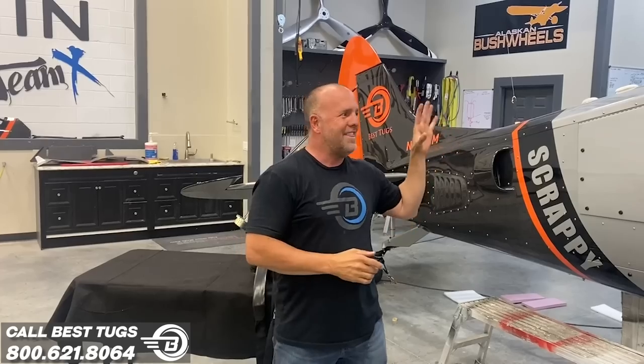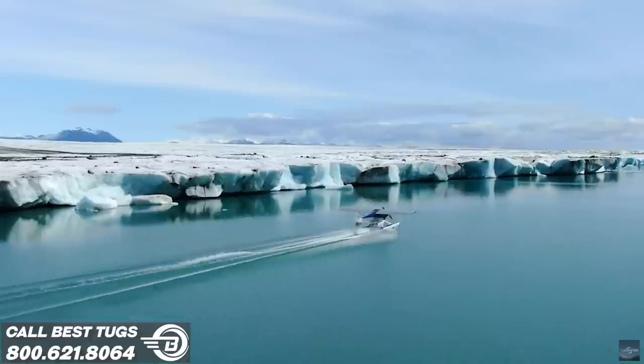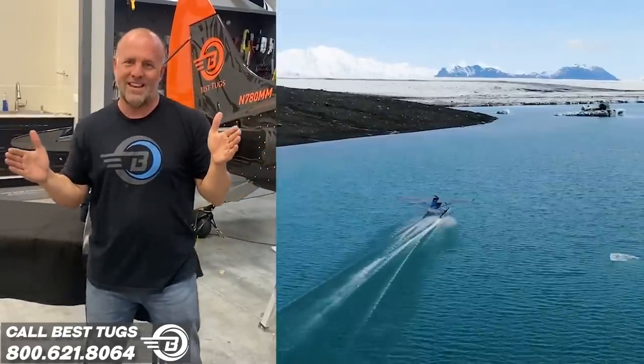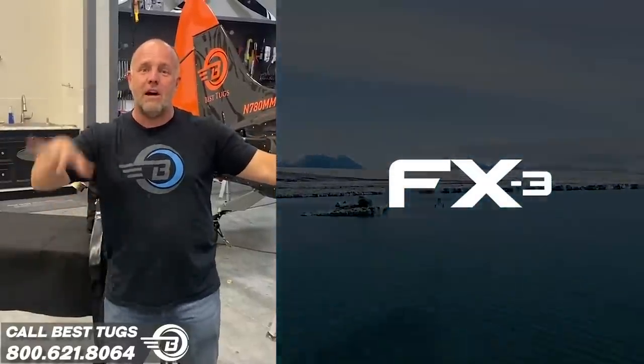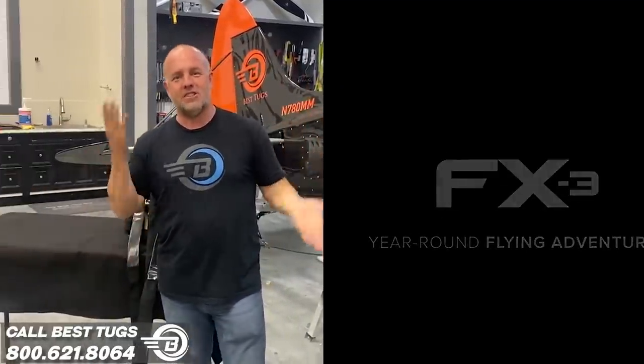I went for a larger chute than what this size plane actually needs, and there's a couple reasons for that. At some point, I'm going to put it on floats, so I wanted to make sure I had a little more weight for those floats, some really long range tanks for all over Alaska. So you need to size the chute to match empty weight and gross weight. That will give you a feet per second sink rate at zero draft of up or down draft thermals if there's storms in the area. So you use that as a baseline, then it adjusts for any thermal calculations to make sure you're okay.